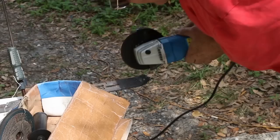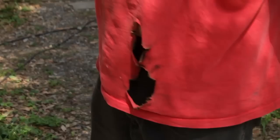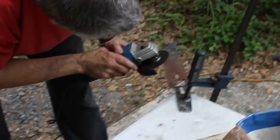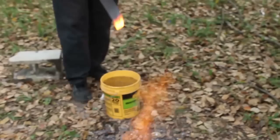Now we're finishing the blade — we're going to cut off the excess. Make sure that you work away from yourself and not toward yourself. This is important. What happened there, Hoyle? I neglected the first rule — safety first. Now I'm putting a rough edge on the blade. This will save you a lot of work later because if you don't, you're just going to be using a file for two, three, four hours. There's a lot of metal to remove to make this into a blade. If you do a little work with the angle grinder, you'll save yourself a lot of work later.